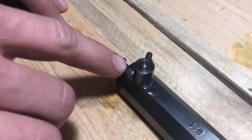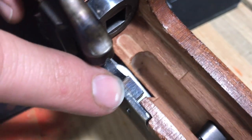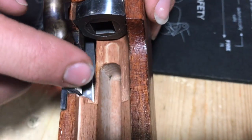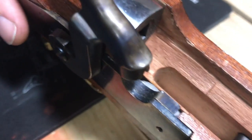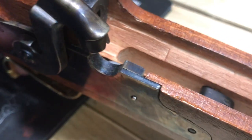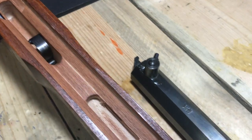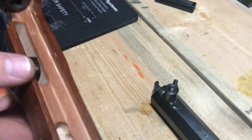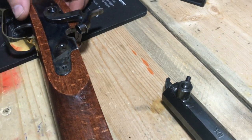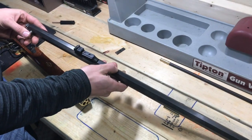Around the right side of the barrel you can see there's a little bit of scratching, and what causes that is the lock plate. If you don't have it sanded enough and you have those screws in too tight, it's gonna rub on that pretty badly. I dry fitted it and those scratches weren't there before I blued the barrel, but after I blued it, assembled it, and then disassembled it — that's where those scratches really show. So you need to be careful about that.